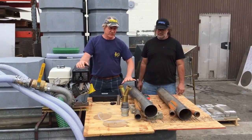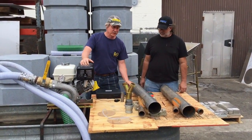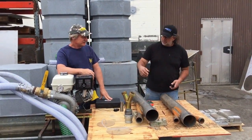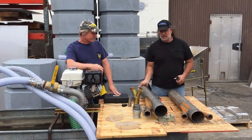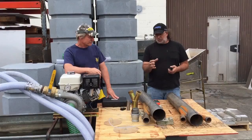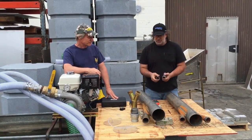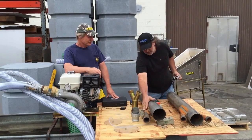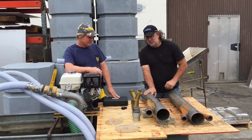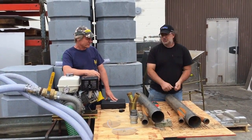We actually have two different power jets right here. We're testing different orifice sizes inside each jet log. Chris built this for me. We're trying to develop a jet log for our brand new HP500 pump. The existing line of jet logs are either too large or too small. So in order to determine the appropriate restriction in the jet log, we've decided to create replaceable restrictors — orifices — in a custom-built, one-of-a-kind R&D jet log. We've just gotten through our testing on this with a single jet log.